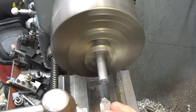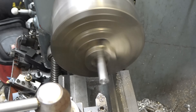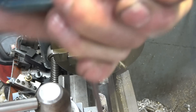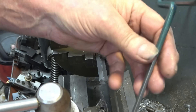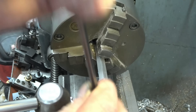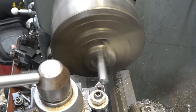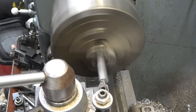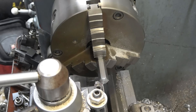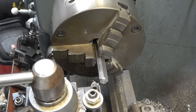The tool wants to come up very slightly. I'm going to move the tool a little bit further. Stick out - as always in this lathe, you want it as little stick out as possible. The thing does flex. This is quite a robust setup but it still does flex. I'm going to put the chamfer on the nuts a little bit more than that. That looks good.